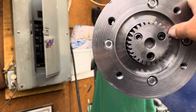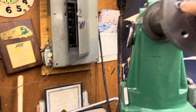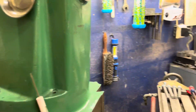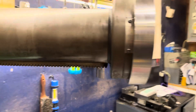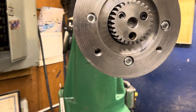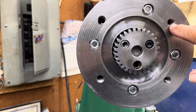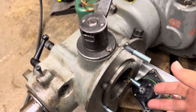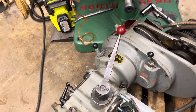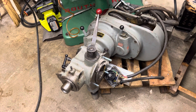This plate would have to be loosened up, and there's really going to be no way to tighten it back up. I could put some access holes in the back, like I did here and here, but unfortunately they don't line up where they're supposed to be. I'm going to get two bolts in here, lay a ruler across it, put an angle gauge on there, and get that thing at zero degrees. That'll mount this thing up on these two studs, which will have me very close. Next step is to get that up there and get it bolted on.